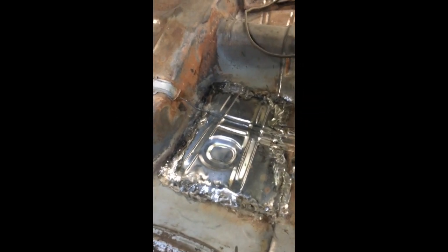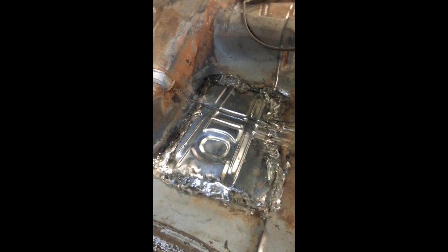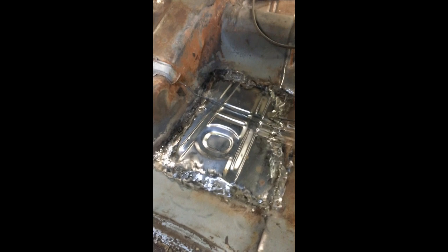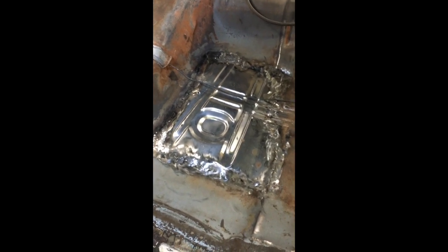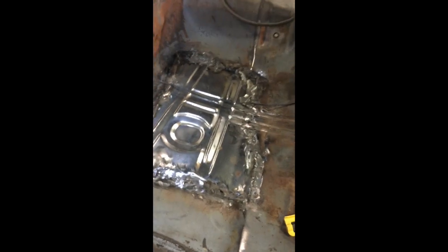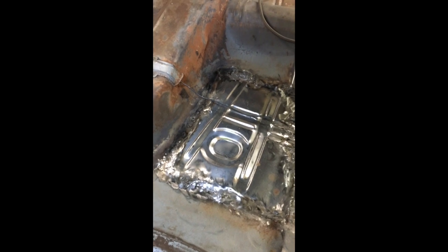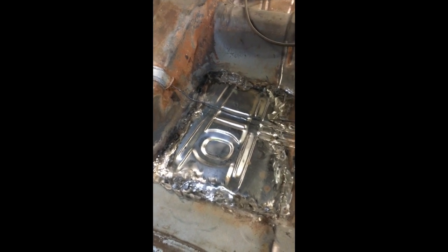Here are lessons I've learned: don't grind too much — be really careful to grind the weld down and not the surrounding metal, and don't get too thin. Make sure you have enough heat to penetrate. I was almost spot welding — picking up the edge of that puddle and doing another little round hit, moving maybe half to three-quarters of an inch at a time, rather than doing an e-shape like experienced welders do. My other advice: get some of the old rusty metal and some new metal, clamp them together and practice.